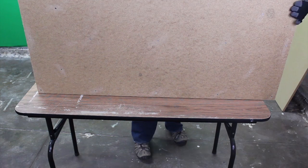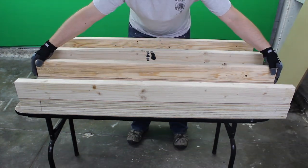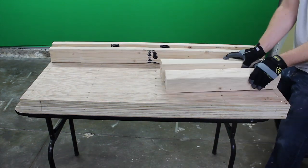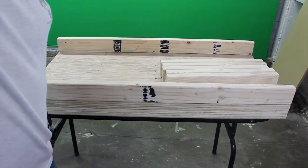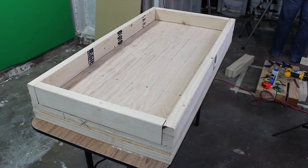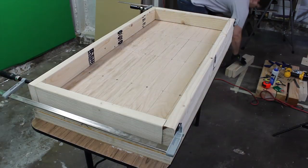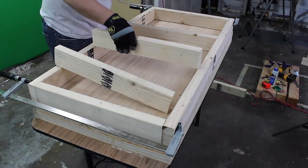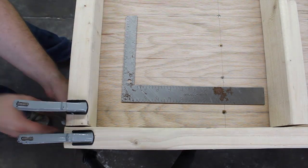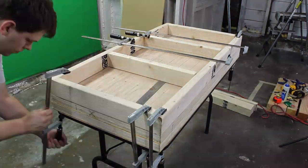Now that our top is basically done, we need to flip it over because we're going to start working on the frame that goes under the top. Take all of your 2x4s and spread them out. You want to find the straightest ones because I don't have a jointer, so I'm picking the straightest ones since I want the top frame to be the best quality — the one on the bottom shelf, who cares. Lay these out, and make sure all your 2x4s are cut correctly since we got them cut from Home Depot and they may be off by about a 16th or so. Get some clamps and hold the outside — trust me, if you don't use the clamps, you're going to hate your life. Make sure this is 100% square. This is your one opportunity to make sure all corners are at 90 degrees, because if the frame's correct underneath, you'll be just fine.